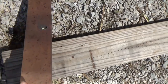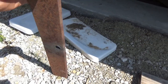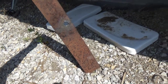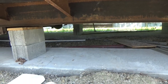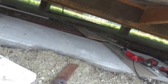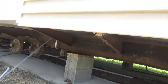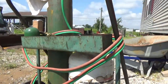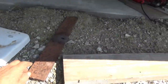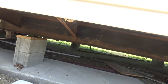I found a piece of metal in my junk — not ideal; ideal would be a piece of half-inch thick angle iron, but this is just flat stock. I burned a hole through it that the half-inch bolt should go through. I'm going to bring the torch underneath there and find that wrinkled spot. I got all my tools down here: my extension cord, drills powered up, getting ready to burn a hole through that. The portable propane torch doesn't burn quite as hot as acetylene — if I had taken it to the shop to burn with acetylene it would have been faster.